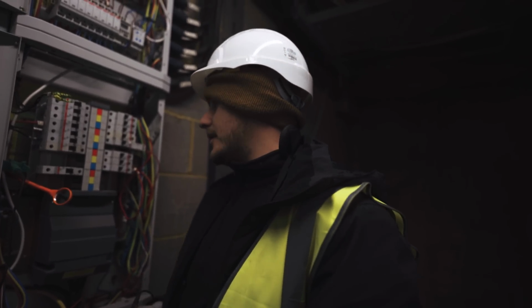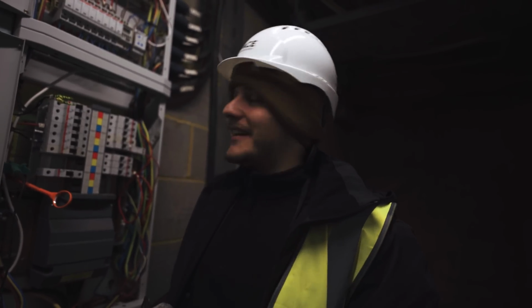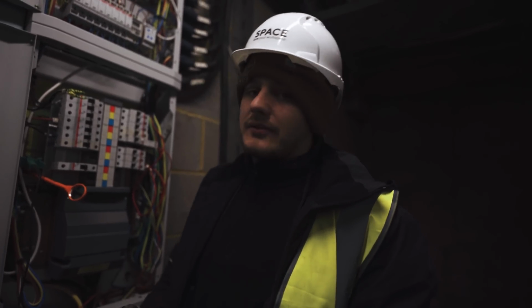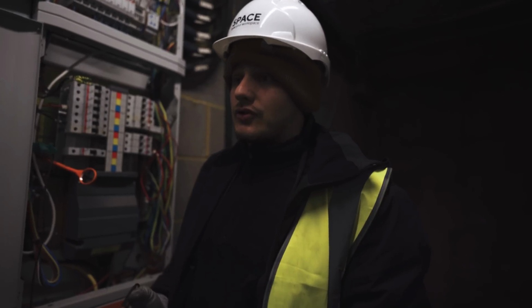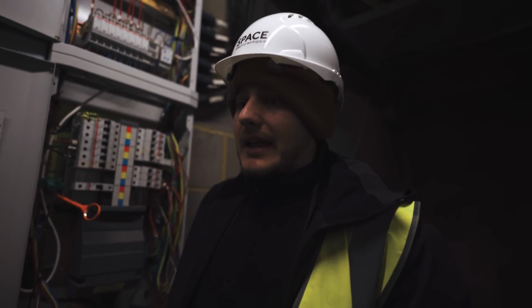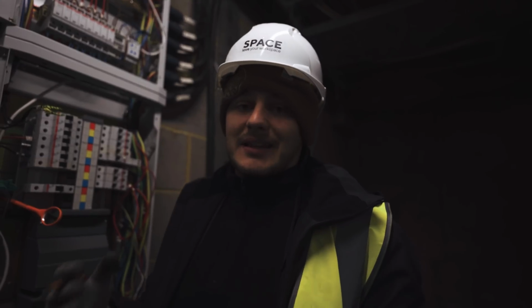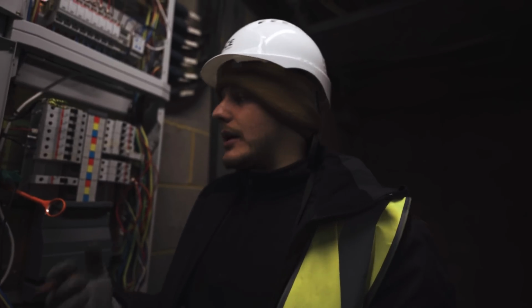insulation resistance testing. Now, I've just spoke to the guys in the office. Personally, I don't think we're gonna get a decent reading, just because everything's damp, everything's made off terribly, everything's connected. Of course, during validations when it's all going to get stripped out, we don't really want to get too involved with that. But I'm going to do it anyway, and what I've advised is, like on initial verification, we do it at multiple stages after this. When all the existing kit's been removed, we've just got cables, do it then, and then when the new stuff starts getting fitted as well, do it then.